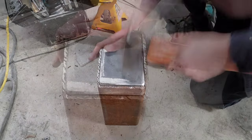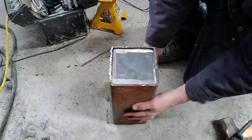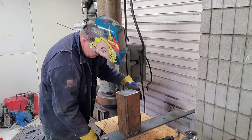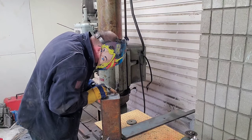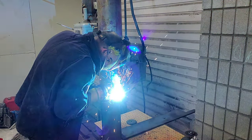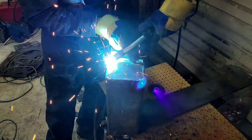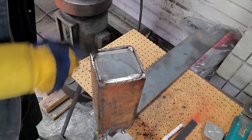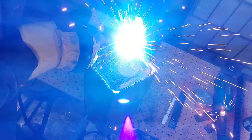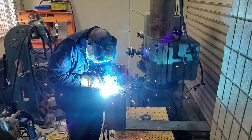Check out this sweet fit — I lucked out and could just tap it in, it's pretty sweet. What you didn't see is I had actually tapped it in about maybe an eighth inch or just under a quarter inch, so that the bottom flat part wasn't sitting on the ground — I wanted it to sit on that lip so I could weld around the inside of that lip as well and get a superb weld. I've been paying attention out in the field watching other welders — they always tell me to weld each of the four corners first and then weld the bejesus out of it, and that's what I did here. It worked out quite well and didn't distort at all.